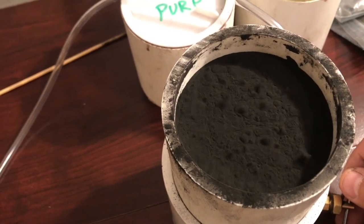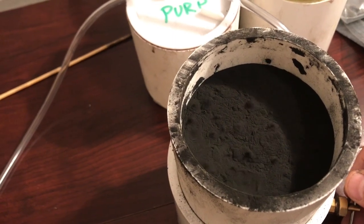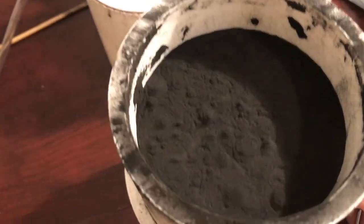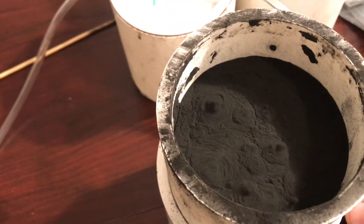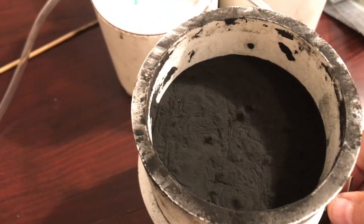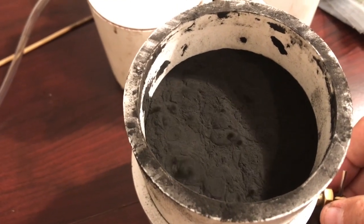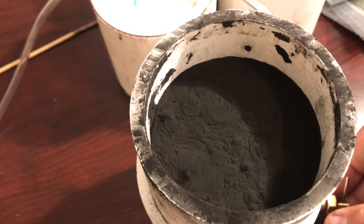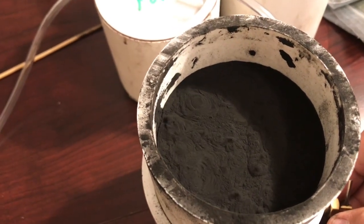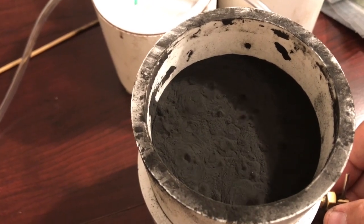So you cut the valve down there just to where it's kind of a slight little, what would look like a pot of water simmering. You just have a very slight bit of movement. That's about where you want it, and you can actually sit and paint thousands of jigs this way, and that thing will run just like that all day long. No powder, no mess, nothing getting anywhere. You just painting jigs, painting.